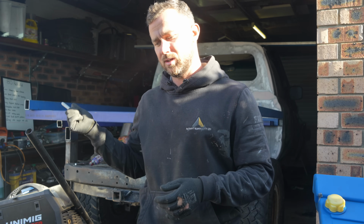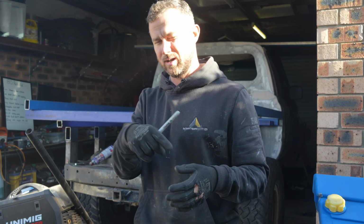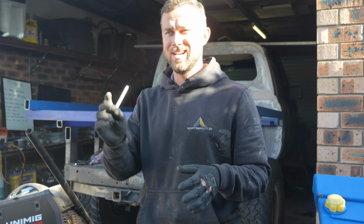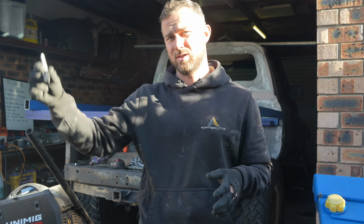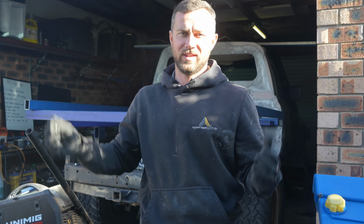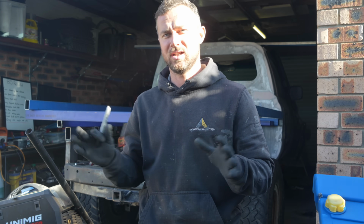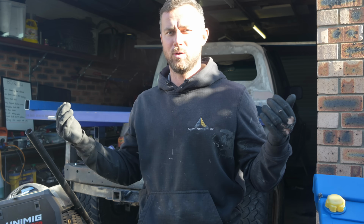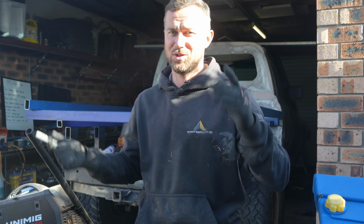And then on the opposite side, so I did on the driver's side 3-4-5, so 300, 400, 500, it was perfect. I went to the passenger side and went 600, 800, a meter, because multiples of 3, 4, and 5. And it was dead perfect too, like to the millimeter. So I squared it and did that trick, and it's perfectly square to the headboard one, which is 20 mil off the cab each side. So theoretically, it should be pretty straight.